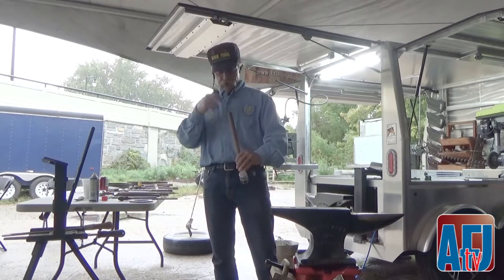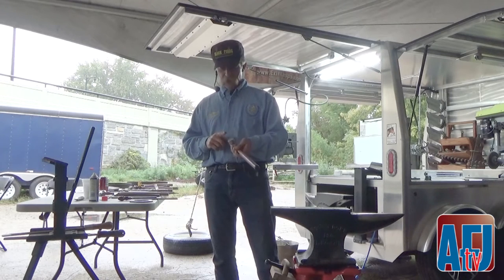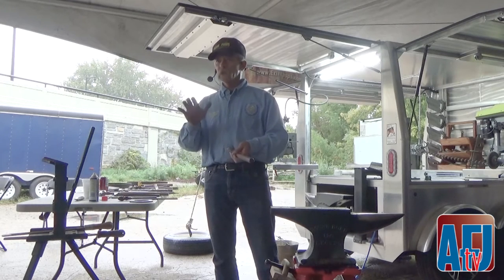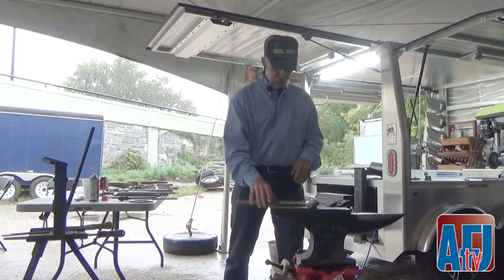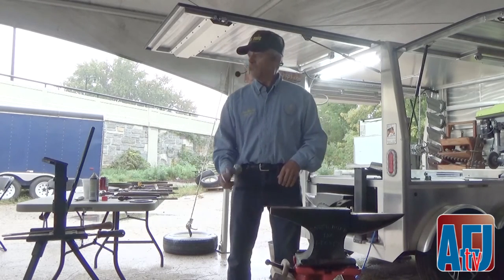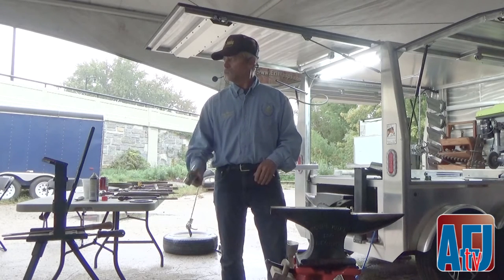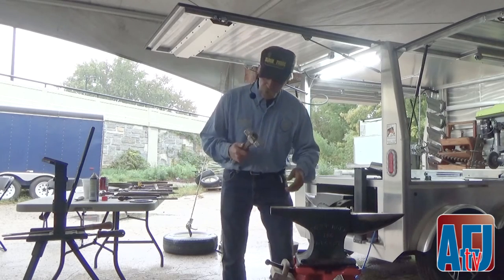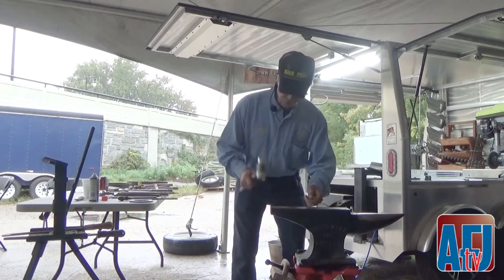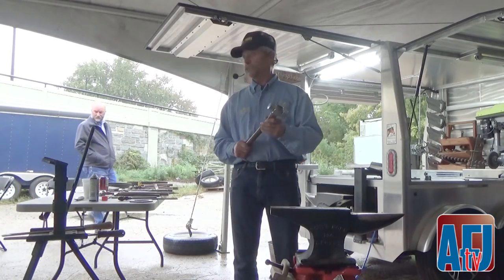What he does is put the narrower side of that egg shape to the flat of his hammer, and the larger round to the round side of his hammer. So when he picks it up, all he has to do is flip it a couple of times and he knows he has the flat down or the round down — he knows already, without having to stop and look. That's a neat trick.